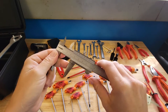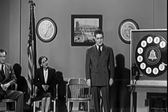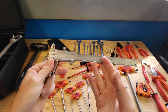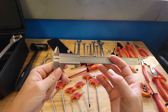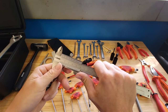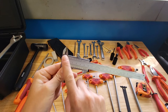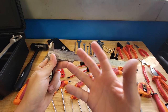I'm glad they included calipers that aren't digital. Some people laugh at this style because it's kind of old school, but it's easy to read. It's not as accurate as a digital caliper, but for bike work you just need a round number — knowing a specific decimal point isn't as important. Also, digital calipers have battery issues and the LCD screens don't work well under about 50 degrees.